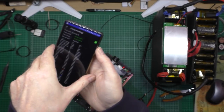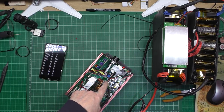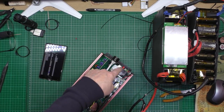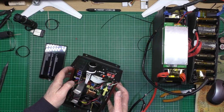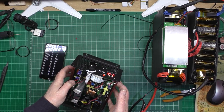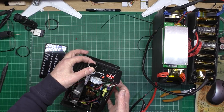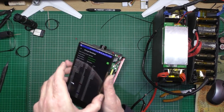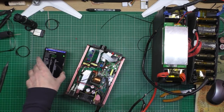So it's actually working. What I've done is, the C negative on the battery goes to the negative on the power supply or the charger, and the positive goes directly to the battery, which is this one here. All you do is you fire that up. There's a light here, which, oh, hang on. You see the light on there? Well, when you've got the right battery connection, the light comes on, and then you can turn it on and you can start charging. This thing here adjusts the current. So, it's working anyway, thank God. Oh, lovely. Finally, that took me 2 hours.